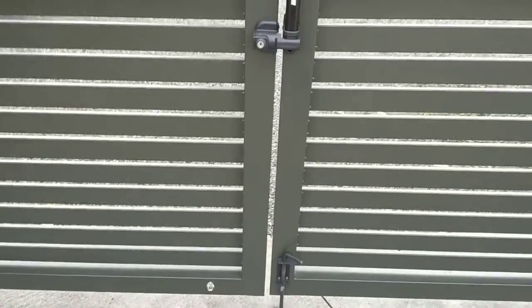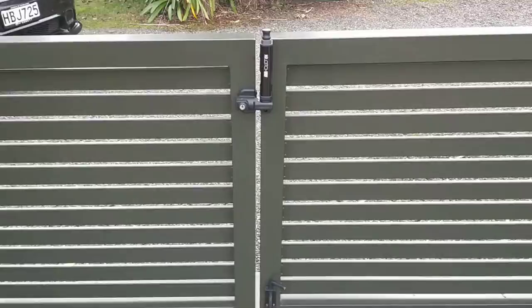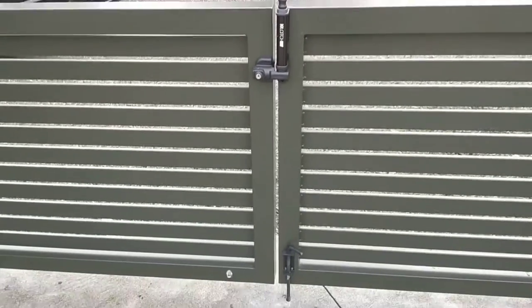Because there's nothing worse than having a gap where it's tight at the top and goes down to 20mm at the bottom. Some people don't seem to mind, but it's always better to have a consistent gate gap — or latch gap — in the middle, especially on a double gate.